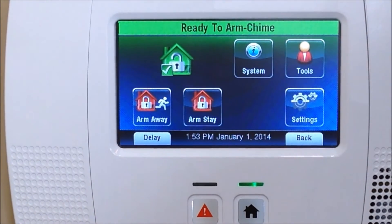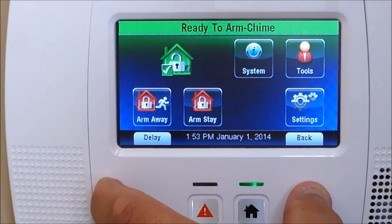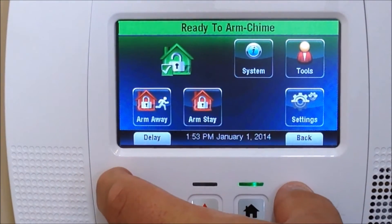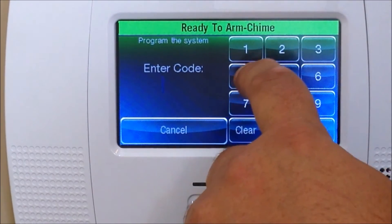Click the back button again. Here's where you would normally test your button and see if it works. If it doesn't work, it may be in high security mode — you can tell by the red LED. Ours is a high security mode button, so once we're done with that step, which normally we'd be done with for standard security, we need to go back into Tools and enter the installer code again.